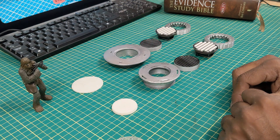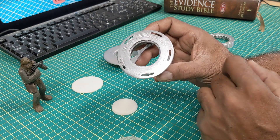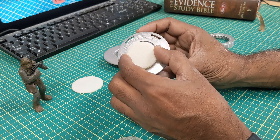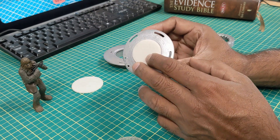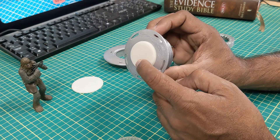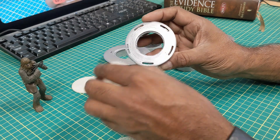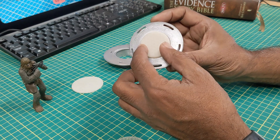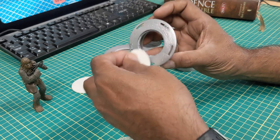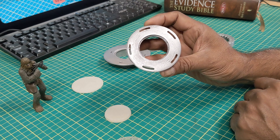Let's take a look at the front first. The front housing is beveled so that it fits the inside of the dome, with the lens sitting flush with the inside dome surface. The lens sticks out one millimeter so it sits flush inside. This can be glued in, but you could just place it there and let the pressure hold it together, since I have a variety of mounting holes for the captive studs to go through.